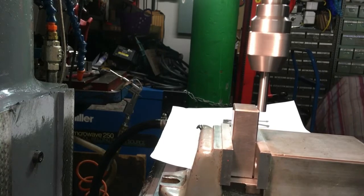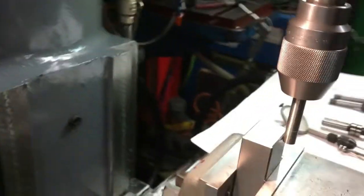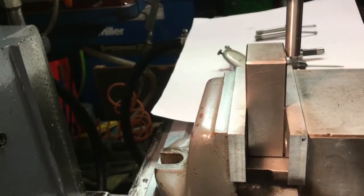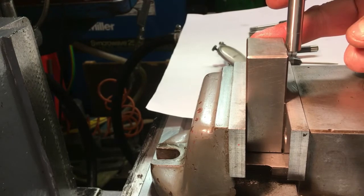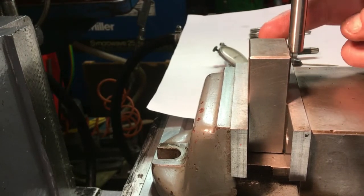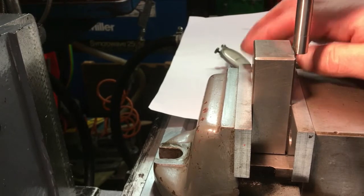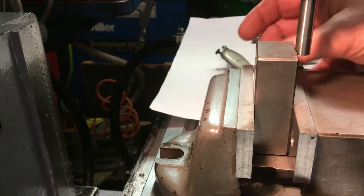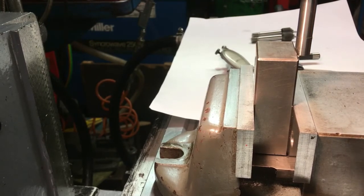That's now just flicked off - you can see it is no longer concentric. This is a 10mm shaft wobbler, so that now means I am 5mm away from this edge. I could then find the other edge and have two datum edges to work off. Normally though you would always work off the back jaw because that's the fixed jaw - it isn't going anywhere when you move it, so if there's any discrepancy in the size of your blocks, your datum still comes off the same fixed face rather than the loose jaw.